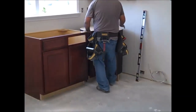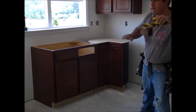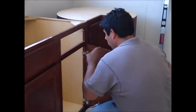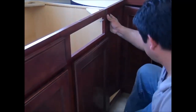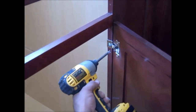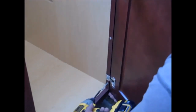Here he's bringing in that Lazy Susan cabinet. He's removed the drawer base that he just used to locate it, and now he'll just screw that Lazy Susan cabinet to the sink base. Again, there's no sides to the cylinder type Lazy Susan cabinet, so there's a couple of different steps to get this thing right where you want it, get that sink base where you want it. Had that just been a square cabinet or a cabinet that had walls, some other kind of corner cabinet, he wouldn't have had to use that other drawer base. He could just simply start in the corner with that cabinet and work his way out.